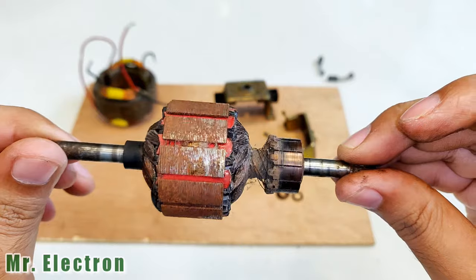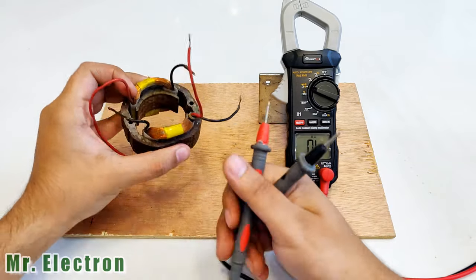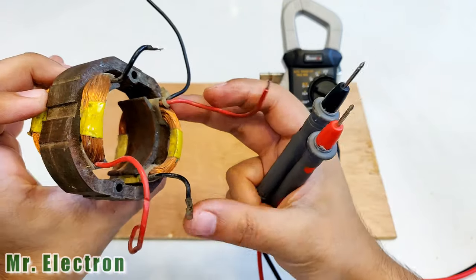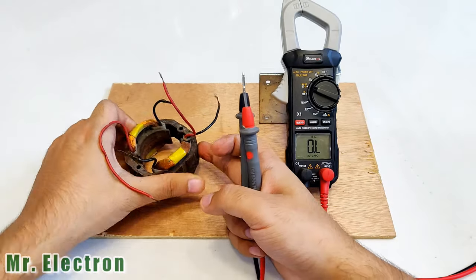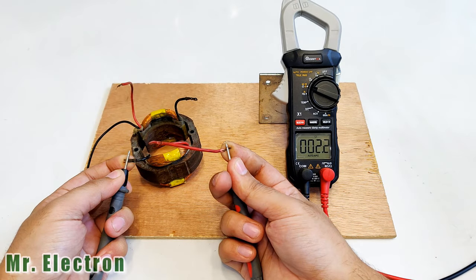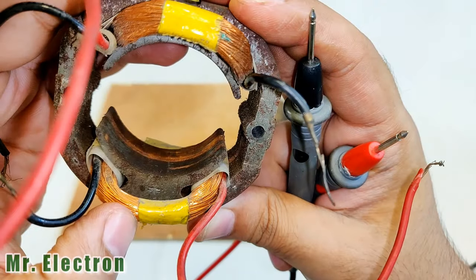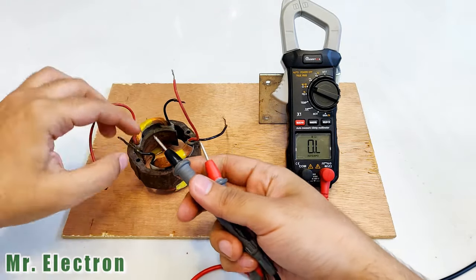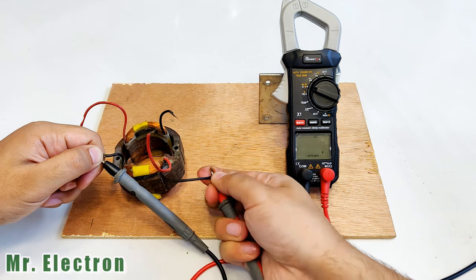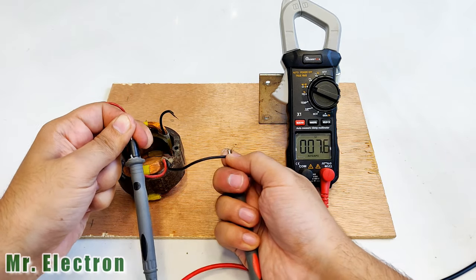The armature is now completely separate. So guys, finally it's time to do the resistance check for each of the two poles. You see that this pole has three wires, so we will have to figure out the maximum resistance wires and then leave out the third wire. Confirming the resistance with the pole with two wires — two point one ohms. The resistance for the other one is around four ohms. What about this? Six point three ohms. What about these two? Three ohms.